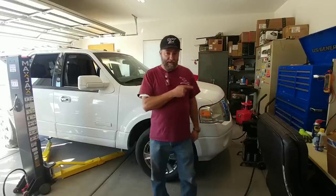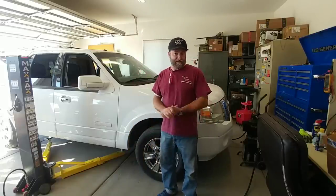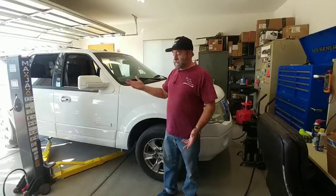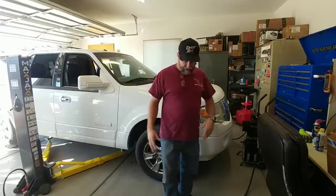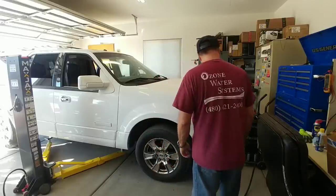I'm also going to put the amp meter on it. When I was looking at them, I couldn't find any specifications on how many amps it actually took, so I've been checking the amperage draw lifting smaller cars. Now this is basically the limit of the jack. I'm curious how many amps it'll pull from the 120 volt outlet when we're jacking it up. So I'll get the jack situated, and then I'll let you see the amp meter as I'm jacking it up.